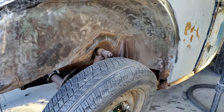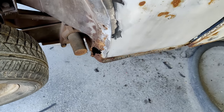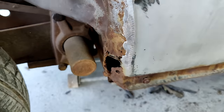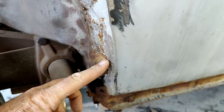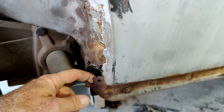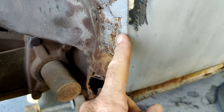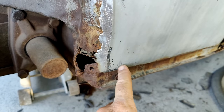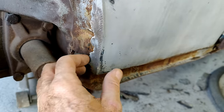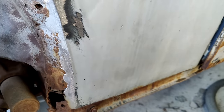Well, let's look at some stuff we found on this. Because you've been watching this all the way through, you saw the back. You may not have noticed, but there was lead back there in the back, and this has got lead in it too. So this has been hit. If you see here, look at the wrinkles, and then they filled it and repaired it with lead. Some people say, oh, that's the right way to do it. Well, it's a way to do it.